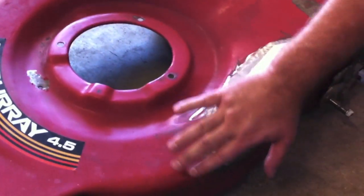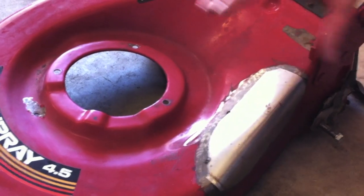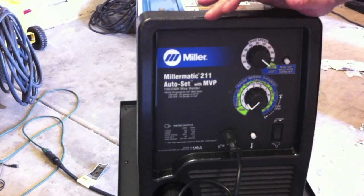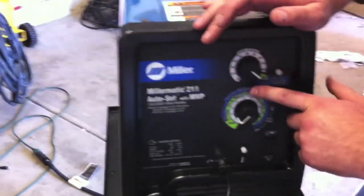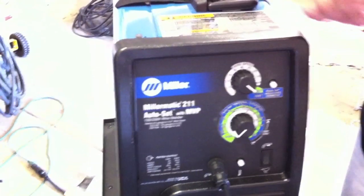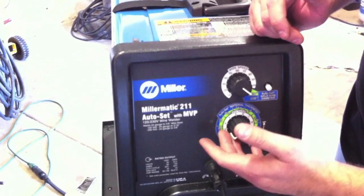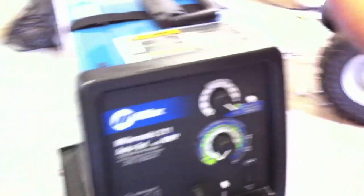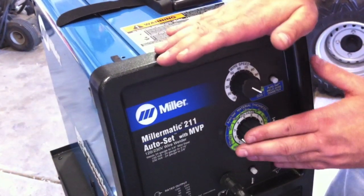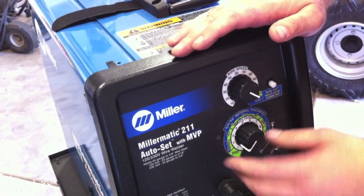Alright, what we did is just did a couple tack welds on here really quick. The reason being is because now we can form it to the actual contour of the deck. Tack welding basically means we hit a couple little spots so it stays in place while we actually bend the metal. What we're using is a Miller Matic 211 — it's the auto set. I love this welder, especially for a newbie like me. One thing I really learned is you can set it to the actual thickness of the metal. Right now we're using 22 gauge, but I've actually got it set to 24 because I'm very slow — on the light metals you don't want to burn through.